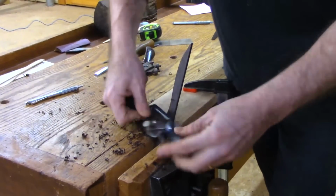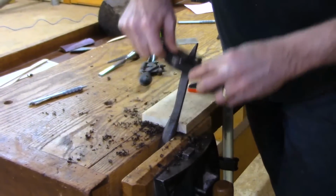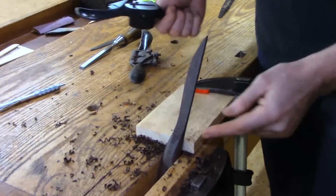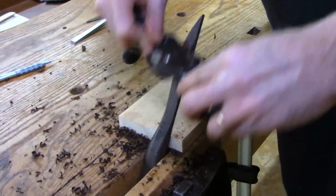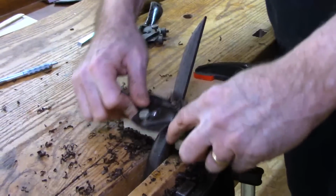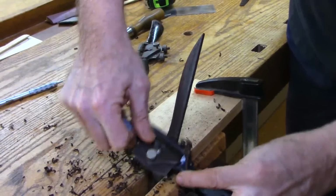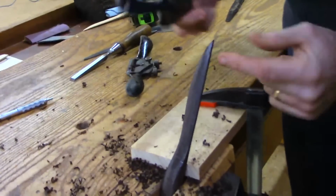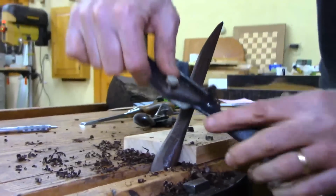And I'm going to come in here. I'm going to use the aggressive one to start with. Just clean off the bandsaw marks. Now I've got my center lines, so I'm going to angle it and come down to my knife edge on this side, get kind of close to it. Then I'll taper it on the top as well. Got to be careful when you get to this point to let up pressure a little, because you could snap that even though it's pretty strong.